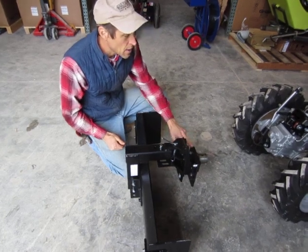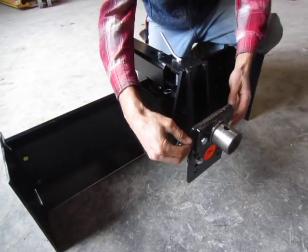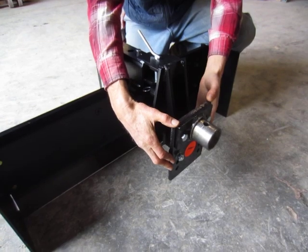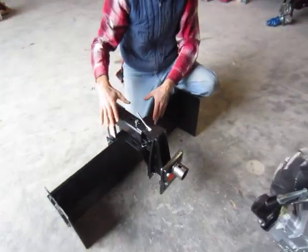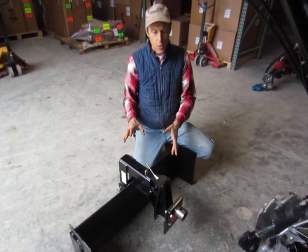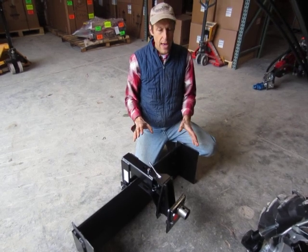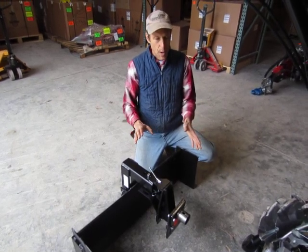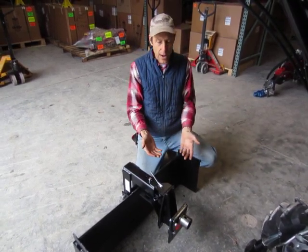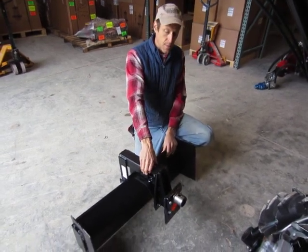This here is a leveler plate — an Earth Tools exclusive at this point. BCS hasn't copied this yet. We discovered many years ago that the dozer scraper blade as set up is really only built to accommodate tractors with either 18-inch or 20-inch tall tires. If you get a tractor with taller tires, the PTO moves up because your tractor is now higher, and that puts the whole thing at a slant when it hooks up to the tractor.